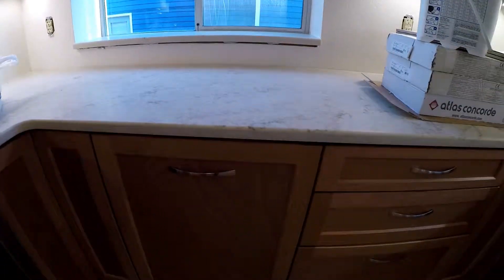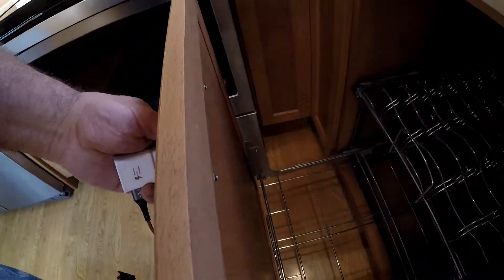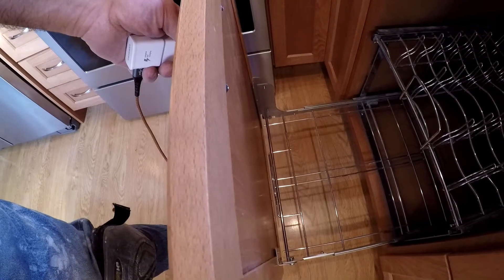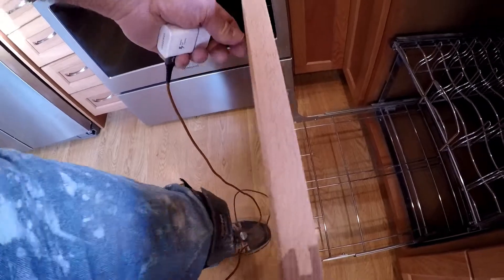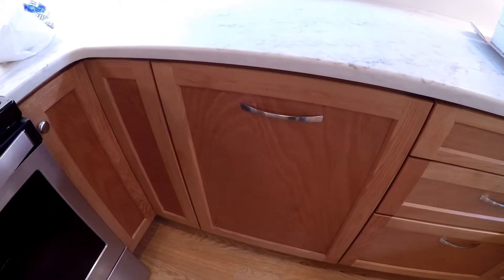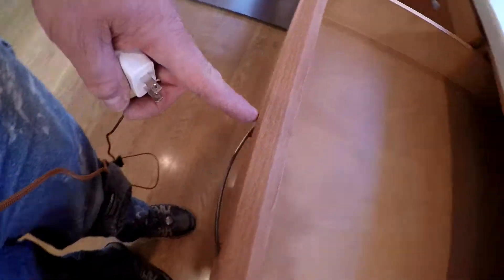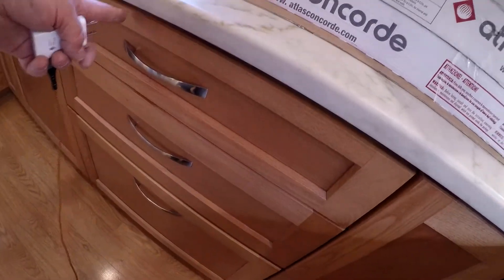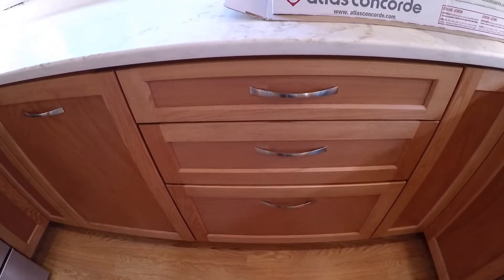I've finished installing all the door knobs and drawer pulls. This one here has a thin panel — it's only a quarter of an inch thick — and the screws are an inch and a quarter, so I had to cut three quarters of an inch off the screw and sand the end to make it a little more rounded so it would thread into the handle better. These ones here, the door is a little bit thicker, so what we did was countersink the backside of the door front about an eighth of an inch.